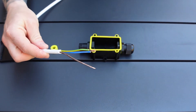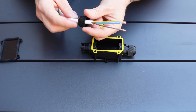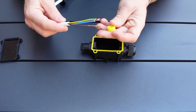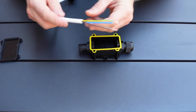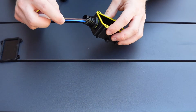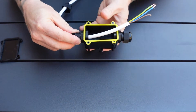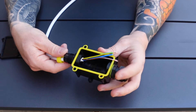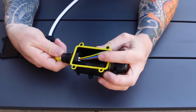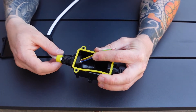Make sure your cable is stripped back to the required length. Slide the gland nut down over the cable and let that slide all the way down, then pop the weatherproof seal on there too. Push the cable into the box and pull it through to get your desired cable length. I would suggest having the sheath stop flush with the inside of the gland, with your stripped-back conductors exposed within the box.